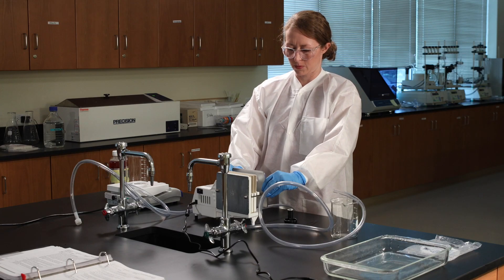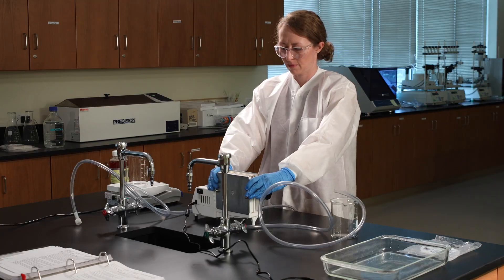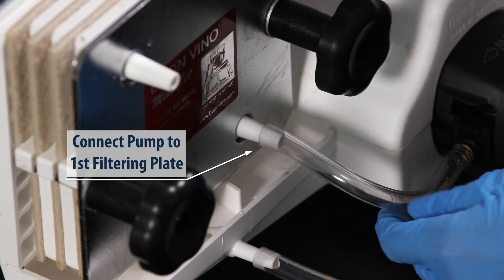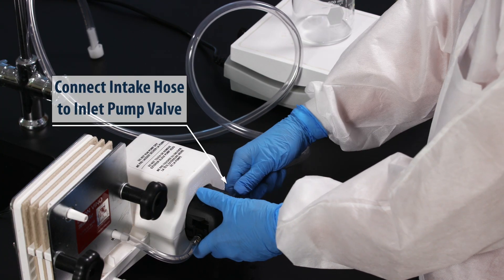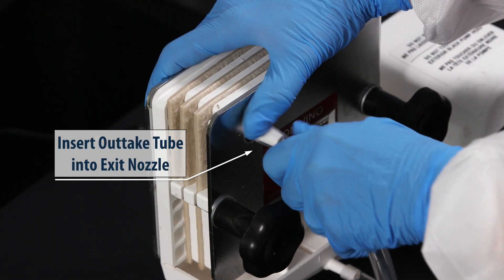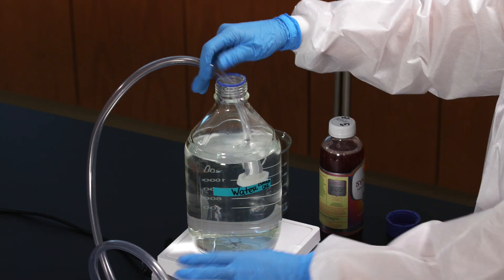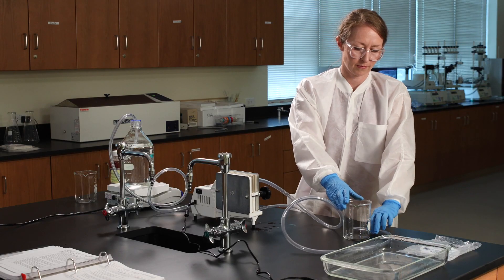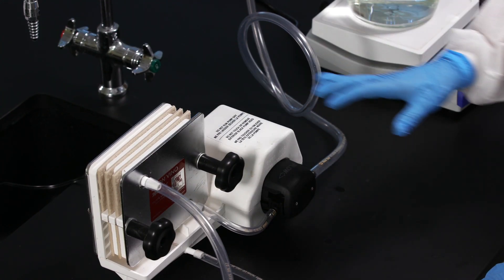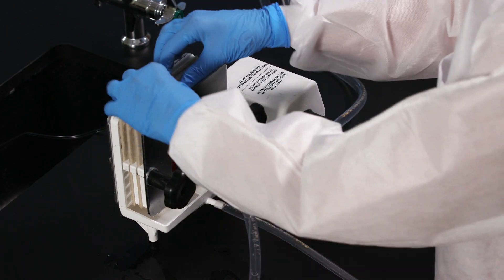Align the guide holes and tighten the hand wheels, alternating each side so that the pads stay balanced. Connect the short tube that connects the pump to the first filtering plate. Connect the intake hose to the inlet pump valve. Insert the outtake tube into the exit nozzle. Let's test the system for leaks. Place the intake hose into a container with at least one liter of deionized water. Place the outtake tube into a clean collection container and start the unit to run the filtration cycle.